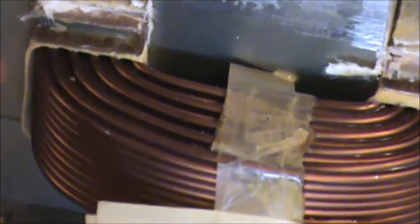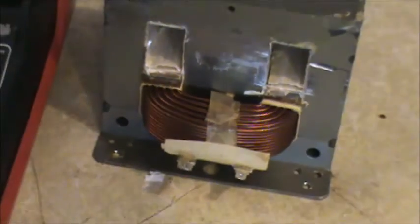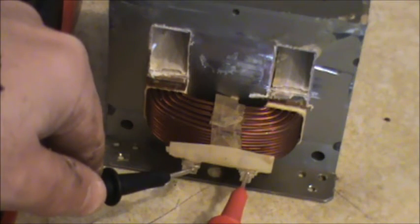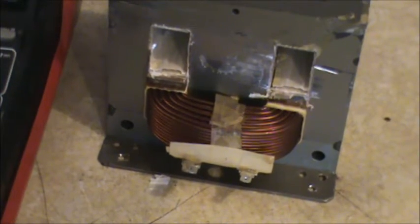Here's the transformer with the primary intact. I still have a couple of wires in here, so I'm taking pliers and wiggling those out. In here, right above the primary, we have some shunts — they're going to stay in place. They're like little spacers made out of transformer laminations, so you just want to leave them. I'm going to check the continuity on this thing — good, we have continuity, so nothing is broken.